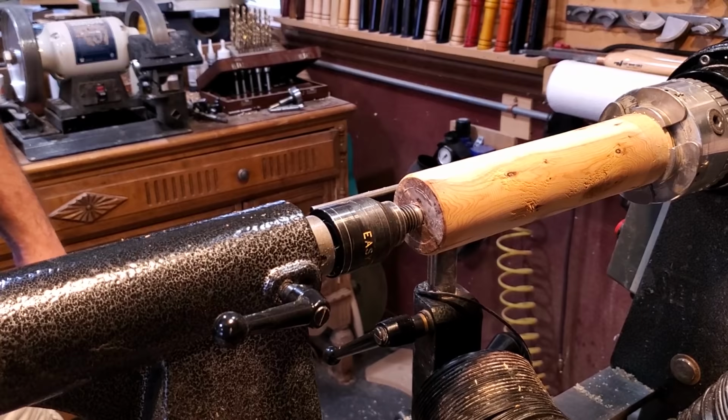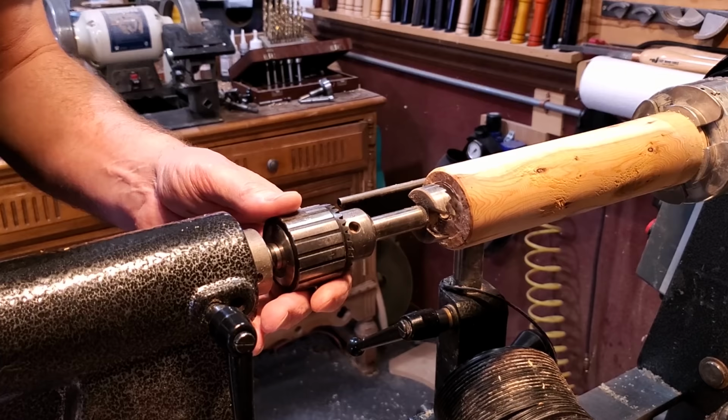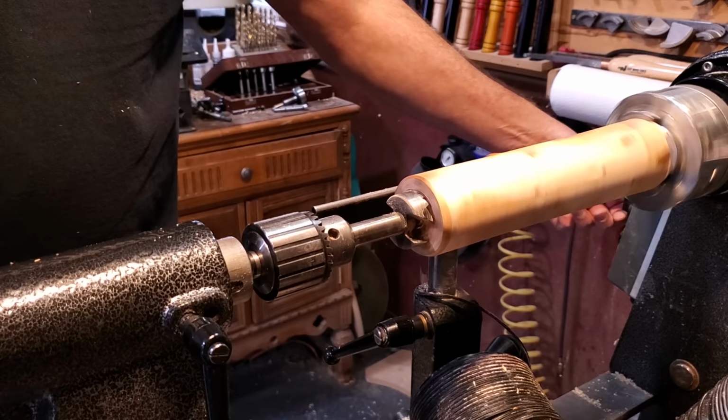I started out with a 1.5-inch Forstner bit. So all the pepper mill kits are probably just a little bit different. This one used a 1.5-inch bit for the hardware to go inside, and you drill down 1/2 inch for that. I'll have a link down below in the description to the kit I used.